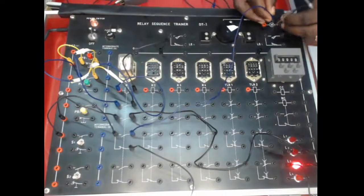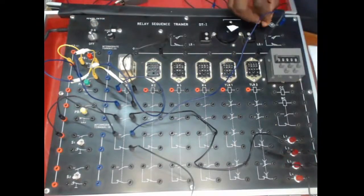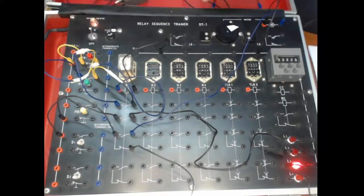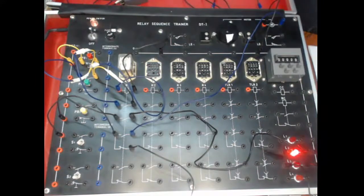The direction of the motor for single phase, like we explained, you simply switch the conductors. So if we interchange the conductors, then the motor will run in the opposite direction, and you can see that opposite direction. If it's a polyphase motor, which is 3-phase, then what you expect is that you interchange 2 of the 3 conductors and the motor is going to reverse its direction.